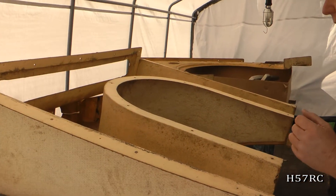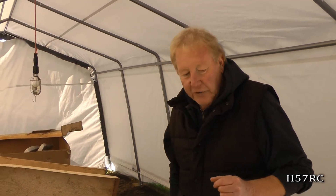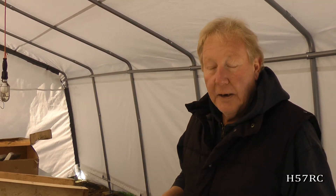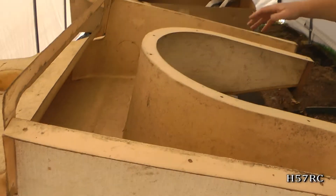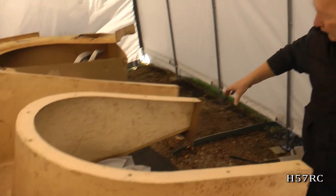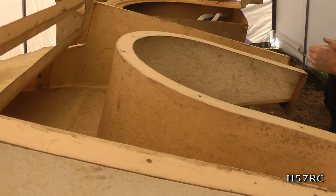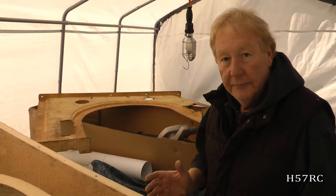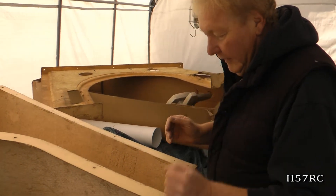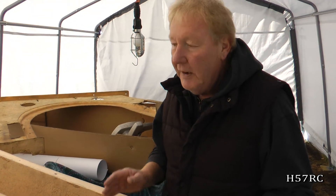These are molds from NA337 — I went down to Trenton to pick them up. This is actually the mold they used for creating the landing gear — the shape of the landing gear truss. This is where the wheel would sit; down here would be the oleos with the axle for the tire. I'm cleaning it up, assessing it, doing whatever repairs need to be done. We can use this to make landing gear for anyone who wants a Halifax landing gear — or if our own landing gear is too corroded, since it's made out of magnesium with steel parts, we can make new landing gear for the airplane.